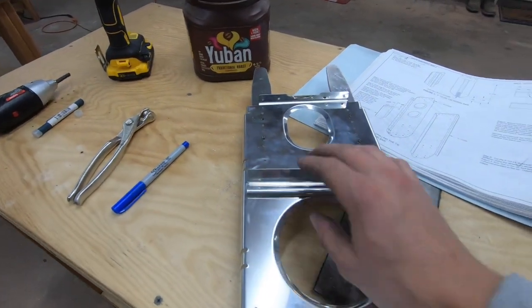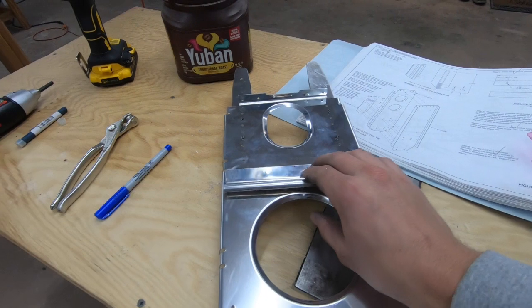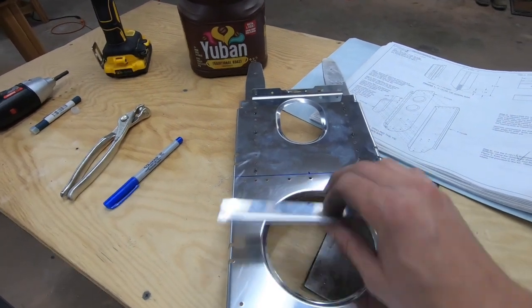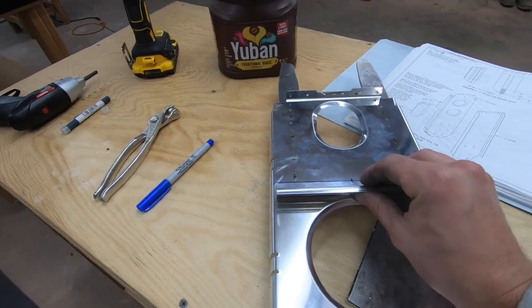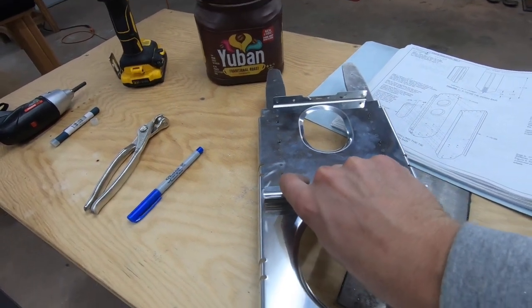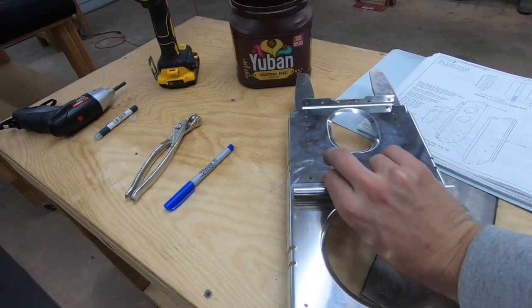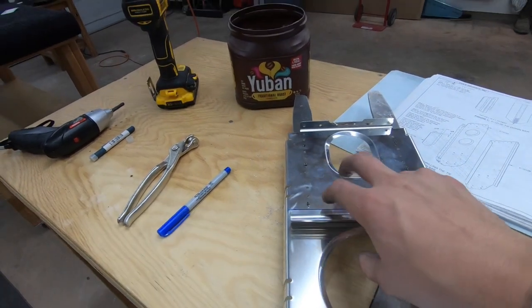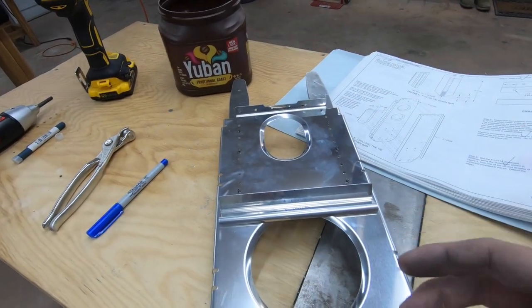They say to use a clamp and then go ahead and drill and send those holes through, but I'm not sure how I'd fit a clamp to sit in here. To make my life easier, I drew out a line of what I need, and I'll just hold it with my immense human strength. I'll match-drill one hole, then get a Clico on it and continue down. At least these lines will help me re-line it up as I get that second hole lined in.